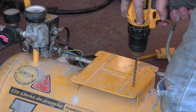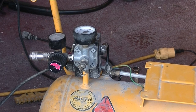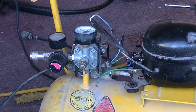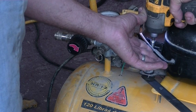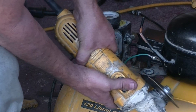I go ahead and drill those holes and get them ready. You'll want to make sure you leave all the safety equipment on — these compressors will just keep going and going, they're very powerful. There's a safety relief valve in front that pops if anything over-pressurizes, and the pressure switch shuts the motor off when it reaches the set pressure, which right now is adjusted to about 110 PSI. You do not want to run these things without those safety features. I then make a small metal bracket for the front to hold it up off the platform.